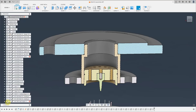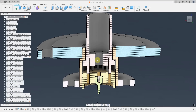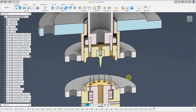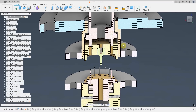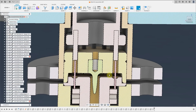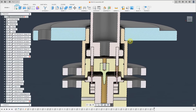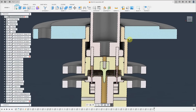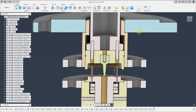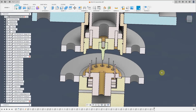So it's some kind of mechanism that helps to eject the stem from the mold. We don't know how the original RCA lead weight mechanism worked, but this is the mechanism I added to our design. It's a pipe with pins that slides through the holes for the pins in the lower mold. When the mold goes down to press the glass, it rests on the pins; the glass is formed, and then when we move the upper mold up, it rests on the pins keeping them down. This few-millimeter travel distance is enough for the glass to unstick from the upper mold, and the stem stays resting on the bottom mold.